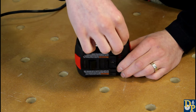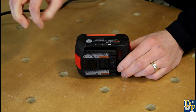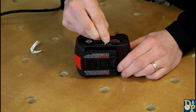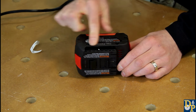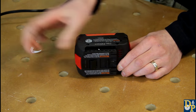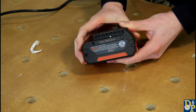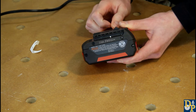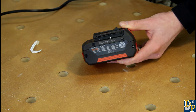So once you've engraved the whole thing, it's just a matter of peeling the label off, and depending on which letters you have on there, sometimes you get the centerpiece still sticking. I find, especially on darker plastic, if you take your finger and rub it over a bit, it will help the letters to kind of stand out a little better. As you can see, it's nice and neat and tidy, very consistent, and it kind of matches from tool to tool since you have the same sizes and the same font printed out. So it looks really professional.